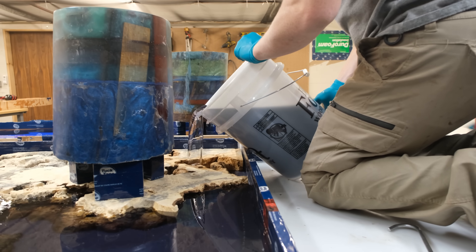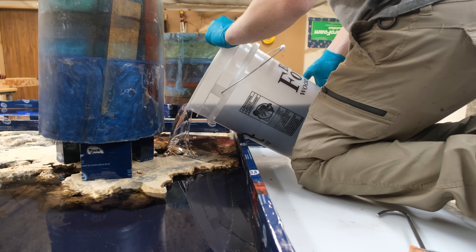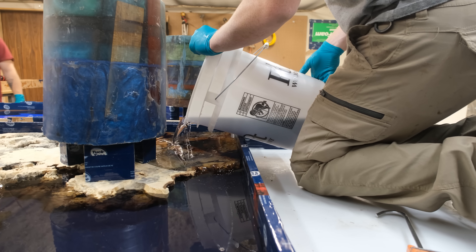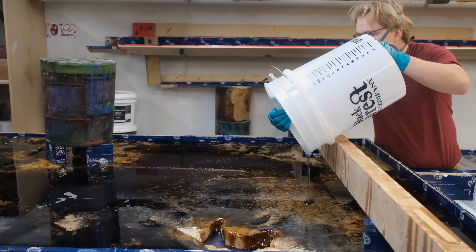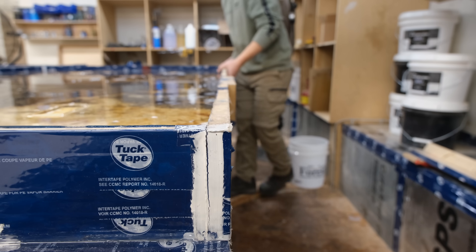For both of these pieces we're using our Black Forest Deep Resin, as it's been specifically formulated for this application. You can pour it up to four inches thick — and even greater with enough cooling — and it has a really slow cure, so there's plenty of time for all the bubbles to get released and come to the surface. After curing for one week in the form, it's time to pop these pieces out and get ready to start flattening them.